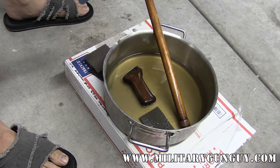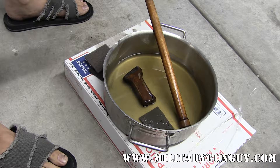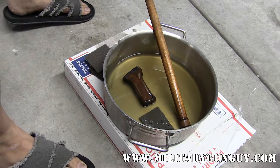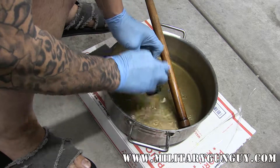The longer you soak it, the better it does. If you have a big enough pot or container, you can actually let it soak overnight, and when you come back in the morning just give it a quick rinse and scrub and it's pretty much done. It completely melts the shellac and leaves the wood nice and bare for whatever top coat you're going to put on.